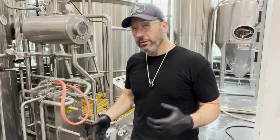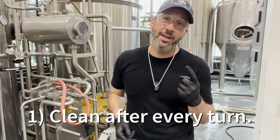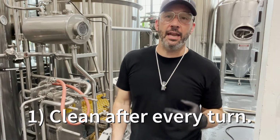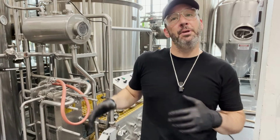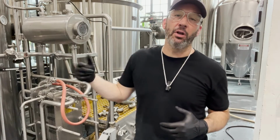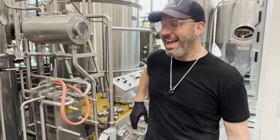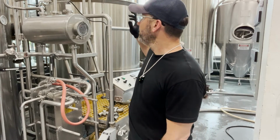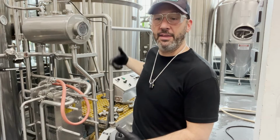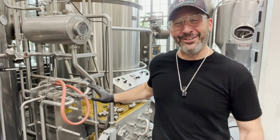So just kind of a big recap. There's a few main things that we want to be doing while we're cleaning our heat exchanger. One, ideally, we're cleaning it after every turn. And I'm talking for all of us pub brewers, people brewing at home, different things like that, right? Sometimes if you're working in a larger place where they're doing multiple turns in a day, we could have a separate conversation about that. But if you're doing one batch a day, and you really can, I would really encourage you to give everything in your wort ways, heat exchanger, and in this case maybe kettle, because that's a typical way that that goes, is looped on smaller systems like this. Get that stuff clean. Run clean to clean every day. I think it's just the best way to maintain your equipment, all right?